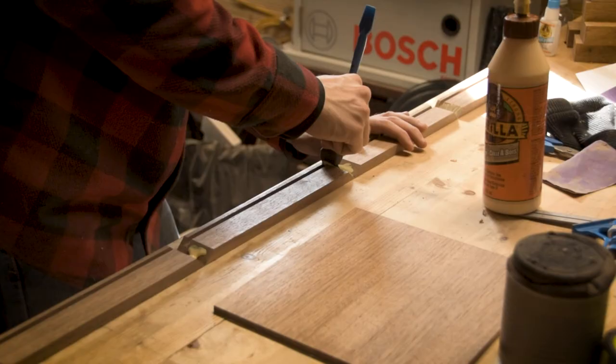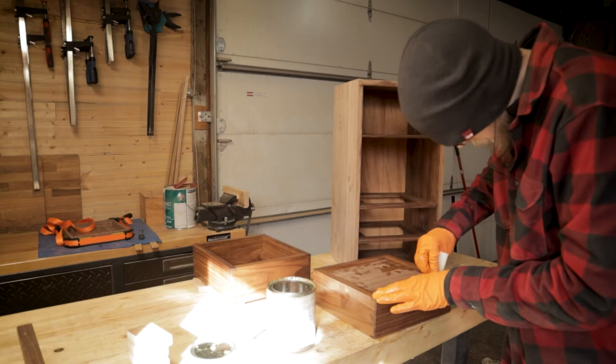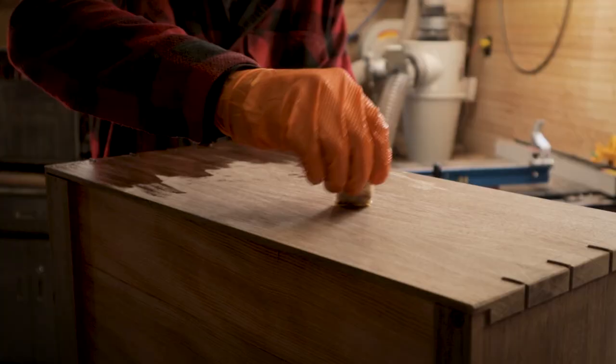This is a nice simple tray utilizing the table saw for all the joinery. For this tray I made sure to make it a little bit oversized and then plane it down to thickness. Then with all of my components together, I could go in and apply finish to the rest of the cabinet. Using tried and true varnish - probably one of my favorite finishes - a nice liberal amount, making sure to get it all nice and oil soaked so that it'll have good long-term protection.